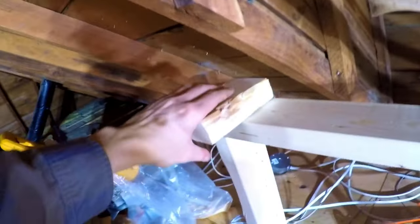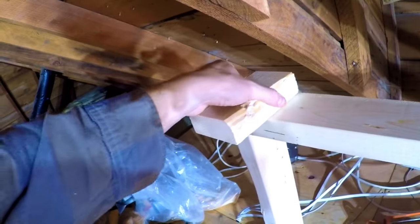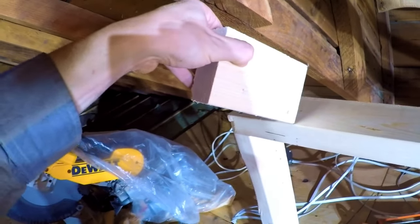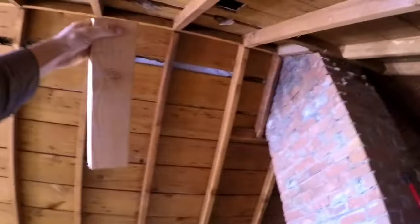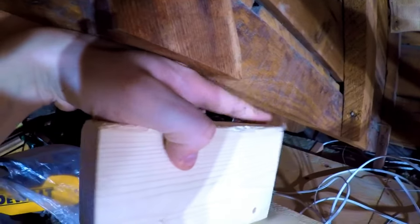It's going to come up flat like this, run up there, and that's going to be the front of the wall. But what I want to do with the 2x4 beside that, which is our joists, is run that beside it. Now, if you look, it's going to line up almost a perfect 2x4 width of the joist going up there. So what I've done is I've cut two chunks, and I'm going to secure them hanging down up there, figure out my distance from the top of this to the bottom of the joist there, so right in between there.